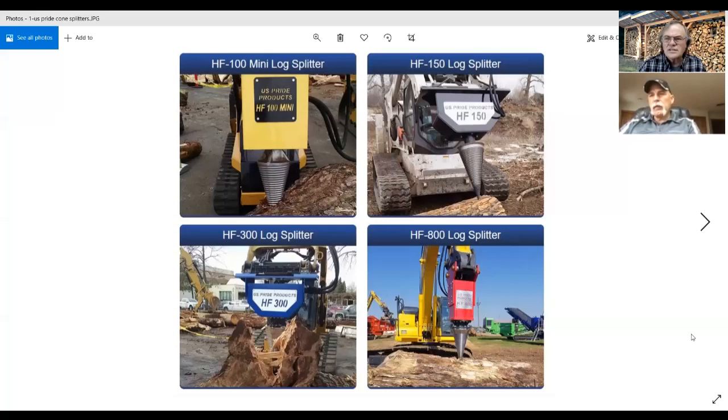Right. Now, a lot of cities do have what they call stump dumps. Once the stumps are taken out by bulldozers with those teeth on the bottom edge to separate them from the dirt, they bring them to the yard, and the stumps are way too big to go through a tub grinder. So you're saying you'll take your Model 800 and bust up stumps too? Yes, and it knocks the dirt and rocks out of the stumps while we do that. So when they go through the grinder, it's a much cleaner product coming out the other end. It's much easier on the grinders.